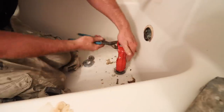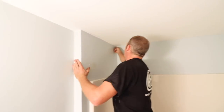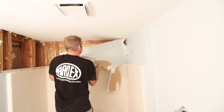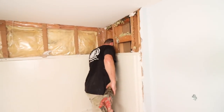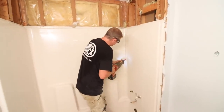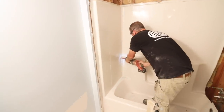This little tool makes it so much easier to remove the drain from a tub. If you're going to be keeping the drywall ceiling, score the drywall tape and simply remove the drywall ahead of time. Then inspect the studs for any kind of electrical and use a Sawzall to cut this one-piece fiberglass tub surround into three different wall pieces.